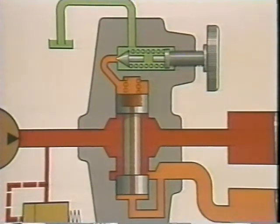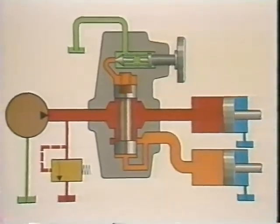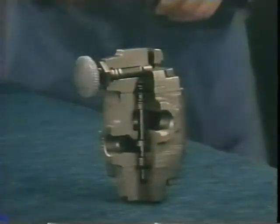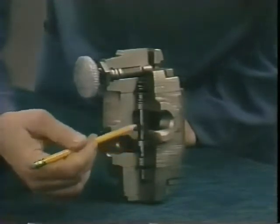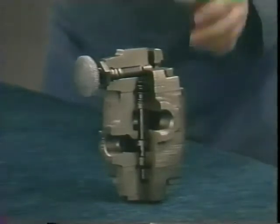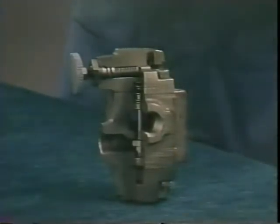Whenever the valve is under control, there is a small quantity of oil flowing up through the balance hole and over the small poppet. Since there is no tank port in a pressure-reducing valve, this control oil must be drained to tank through a small port in the top cover. Here we have a pressure-reducing valve cut away so we can see the sliding spool and the light spring which holds it open. The sensing passages are actually small holes drilled into the spool, one of which lets oil flow into the top cover where pressure is limited by this small poppet and spring. This hump on the back contains a check valve to permit reverse flow, if for instance we wanted to retract our cylinder.